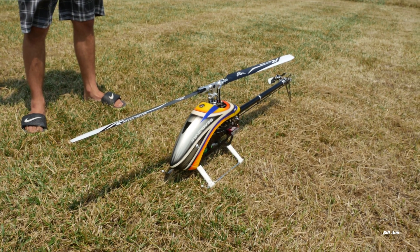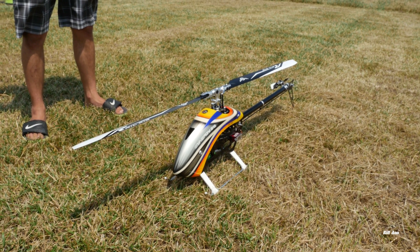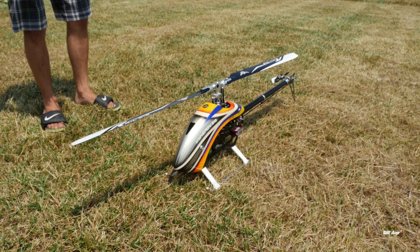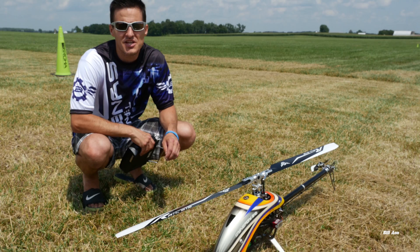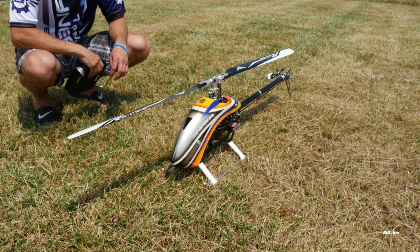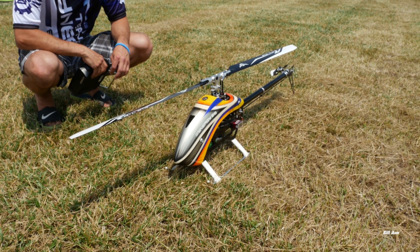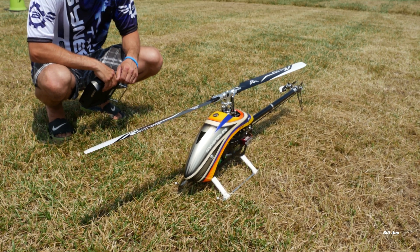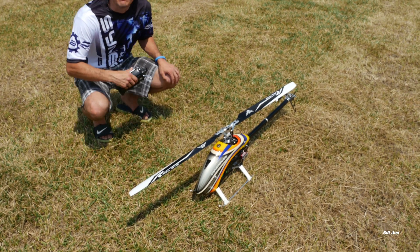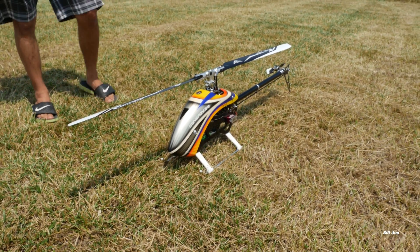All the components are relatively cheap. The Talon 90 and Scorpion Motors is a 500 class. Let's talk about motors — what type of motor size and KV? It's a 4020, 1350 KV, at 2700 RPM, which is definitely on the high end. It flies great at 2400, even 2200 with the stock tail ratio. And the ESC — around 100 amp? Yeah, 100 — this is a Talon 90 with the built-in BEC. And the MKS servos — we designed it around the MKS cyclic servos. They fit the best and have the best geometry.